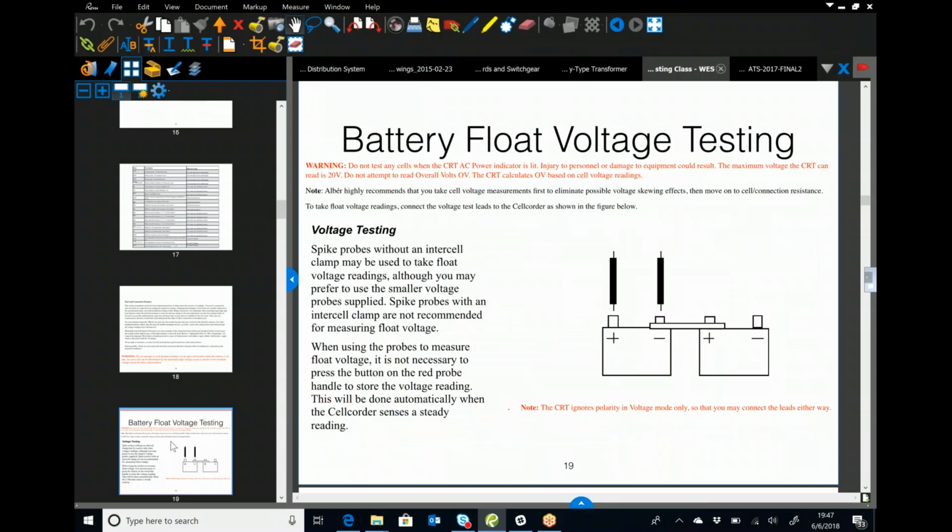That's not what we want to do. So as you come in and you start testing your batteries, you've got voltages first. The unit does not care on your test leads what's red and what's black, what's positive, what's negative. It only sees it as a positive voltage. You can run through much faster, just daisy chaining as you go through and read. So if you go from the first jar here at negative, you can leave your negative in place and go to the next negative with your positive lead and get that next jar's voltage.